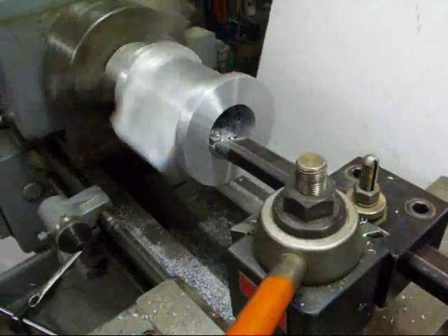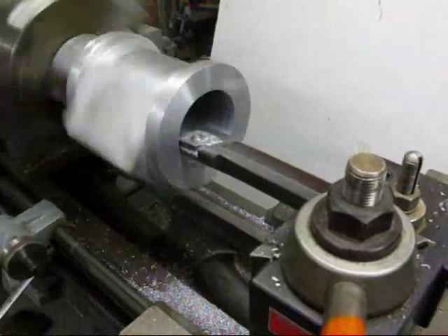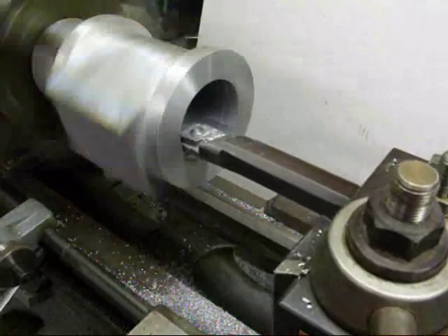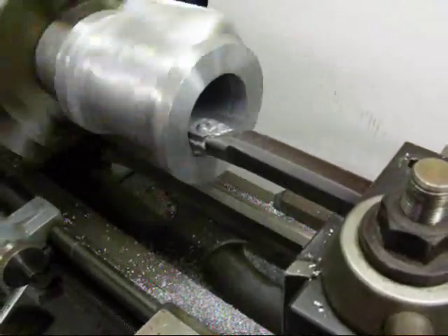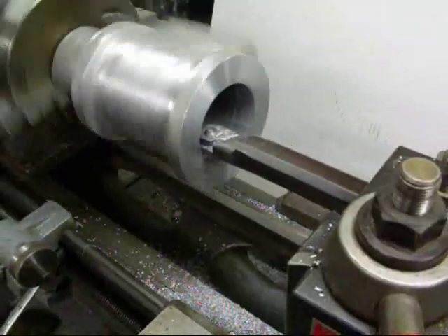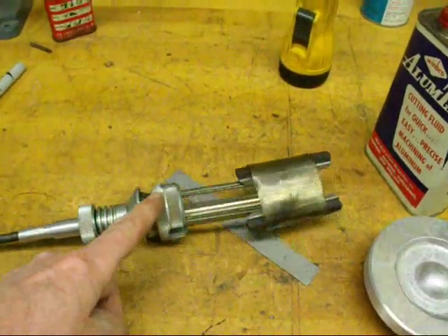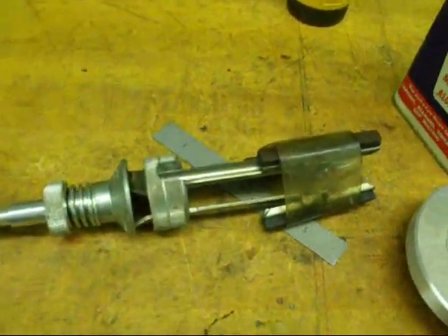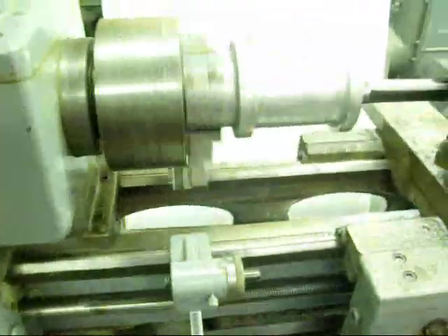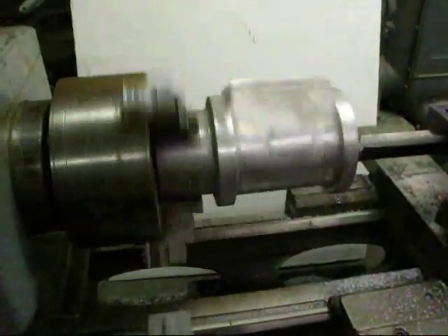This is the very last finishing pass for the cylinder bore — only taking a few thousandths off and I'm feeding it extra slow. Then I'm going to hone it. I won't show this on camera, but I'll use a cylinder hone to smooth it out a little bit. I don't think it's critical but I'll go ahead and do that anyway. Then I'll take this over to the band saw and saw off the waste stock that's being held in the chuck.